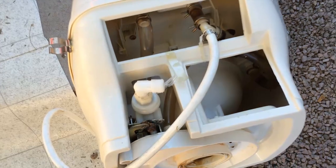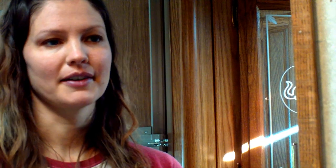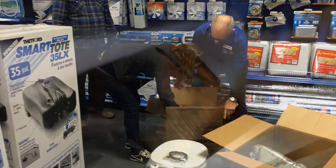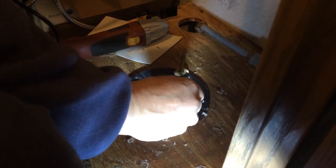We finally had the toilet out, but we still didn't know exactly where the leak was. We had a suspicion. On the back of the toilet, there is a metal mechanical part that runs the pedal of the toilet, and that had a lot of buildup from hard water. So we thought it's got to be coming from the mechanical metal part. We decided the best thing to do is just buy a new toilet versus replace or fix the mechanical metal part. The old toilet had a very interesting way it was screwed into the floor — the slots for the bolts actually lined up at a diagonal angle, whereas most toilet bolts line up perfectly straight across. We tried to remove the flange from the pedestal so we could turn it to fit the new toilet, but it turns out it was glued at the pipe, so we couldn't remove it.